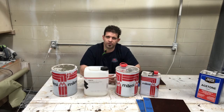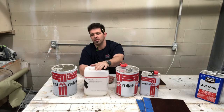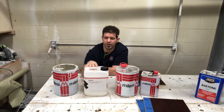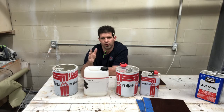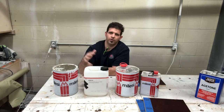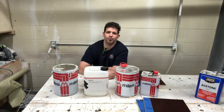If you have an HVLP setup, you're probably going to have to run somewhere up to 30 PSI to get it to come out. It just takes a ton of atomization to shoot these higher-solid water base coatings. With water based stuff and tips on air assisted airless, they tend to use smaller tips — between a nine and a 13. If you're shooting vertical, you'd probably want to go with a nine or an 11. If you're shooting flat and doing giant panels, go with a 13 — you could just lay it on super heavy. That's going to control your flow rate along with your fluid pressure on the air assisted airless side.